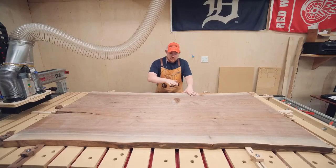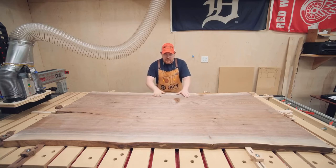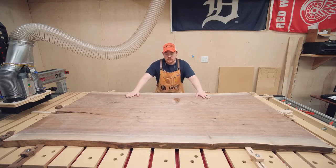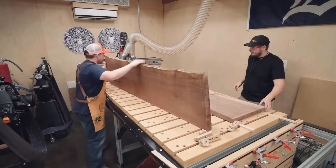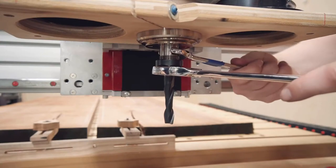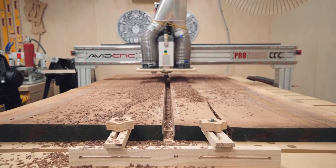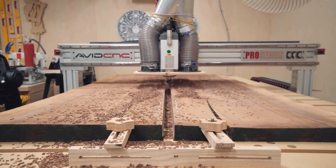We got the bottom side down to a rough bottom plane. We're not going to go too crazy to make sure we get 100% of these because that's going to be the bottom side and it's not too important. What we need is a nice flat reference surface just to get a 90-degree edge before glue up. So now we can flip these upside down so that the flattened side is up against the spoil board, line it up so we know the location of our rough straight edge, and use the machine to cut an accurate straight edge perpendicular to the freshly flattened face.